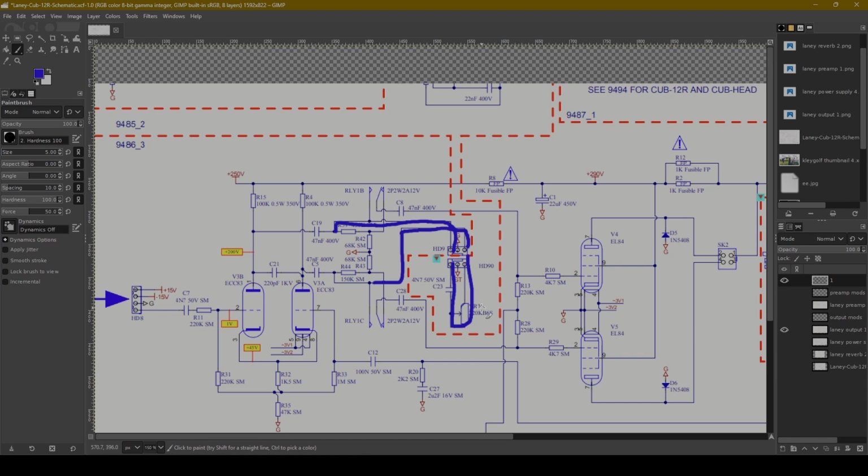So I believe what's happening is instead of it being a 1 watt mode, when I think of 1 watt, to me that would mean that the voltage rail, the B plus, is being affected in some way. The high voltage that's being used in the amp is being changed. But that's not really what's happening. It's just a post phase inverter master volume, which is a curious and interesting way of, I'm not trying to be critical of why they call it a 1 watt mode, because it really isn't, but it kind of acts like that, and it is a useful tone shaping tool.